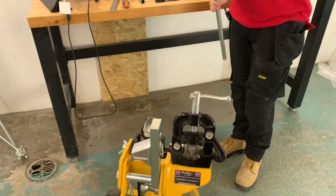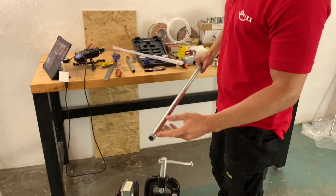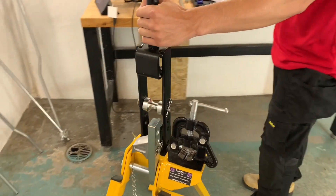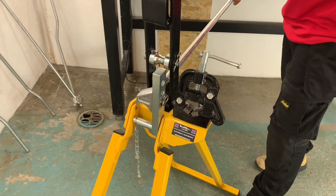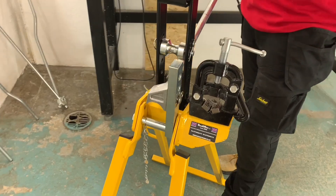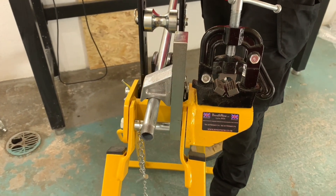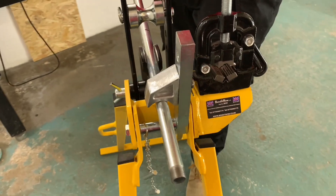I need to be sure that I insert the conduit into the bender from the end I've measured from. Pull the arm up — the roller bar — as well. Yeah, as covered in the video on understanding your conduit bending machine. So that's the measured mark going in, and I'll make sure I'm under the stop.